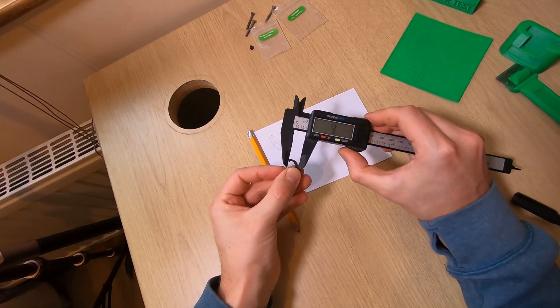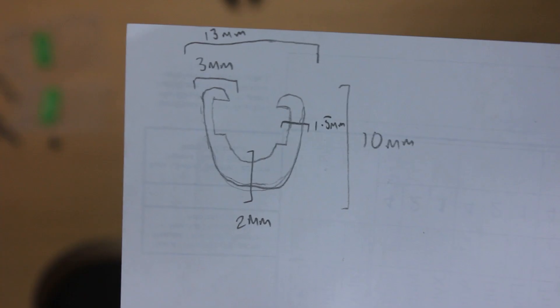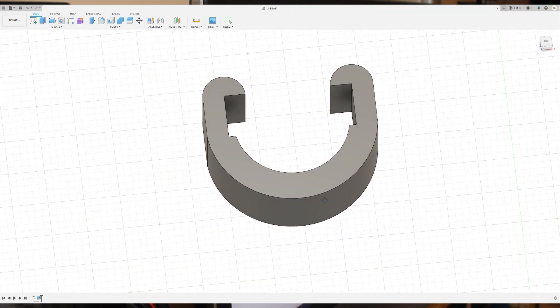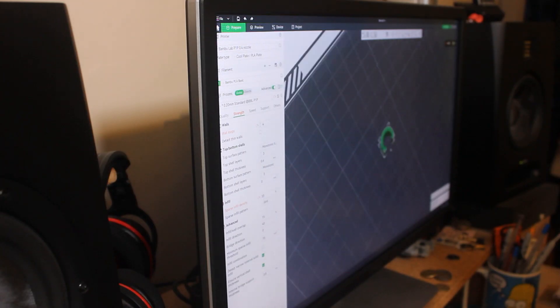Firstly we'll check the height, depth, depth of the little hook, the width at the top, the width at the bottom — that's the rough drawing we've got to work with. So we'll attempt to put this into some sort of 3D modelling program. I've got my basic shape drawn out. There's one difference in that these lines at the edges are vertical, and on the actual clip they flare outwards slightly, but I'm going to ignore that for the moment and see if this would work. I'm using Fusion 360 — I went into sketch mode and used the line tool and a three-point arc to make this shape. I've extruded it out five millimetres deep and I think this is good enough for the first prototype. I need to export this to the slicer in Bambu Studio now.